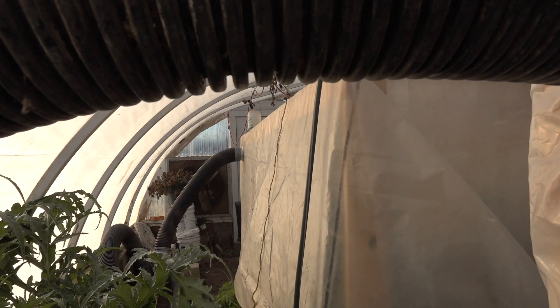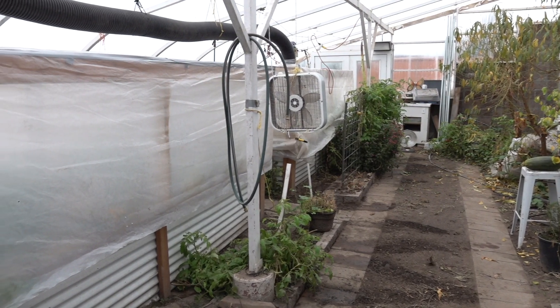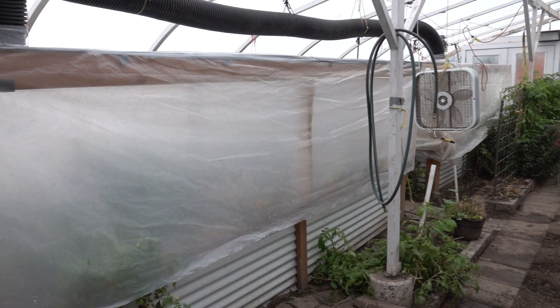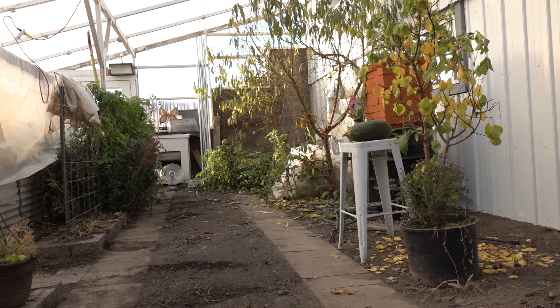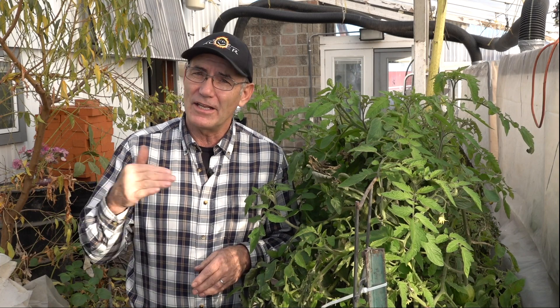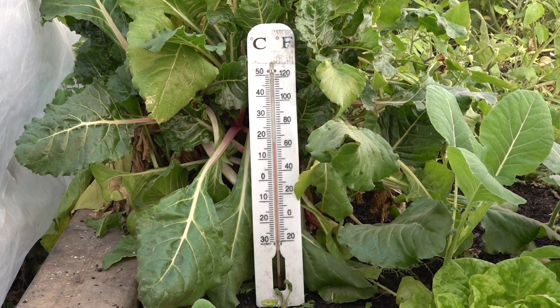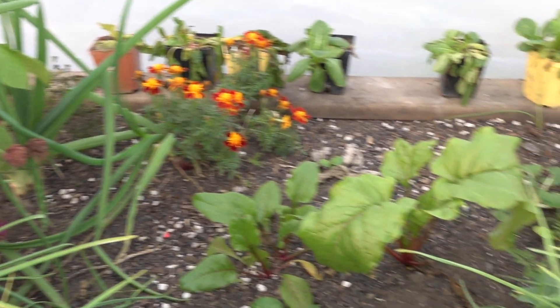To recap: having more zones in here has kept the temperature from freezing. Separating the climate battery zones into heated zones in the planter boxes and the shipping container has worked well. The fourth zone is still out here in the main room — we'll probably let that shut down after the tomatoes are done, which will be pretty soon, and allow the trees to winter and the ground to freeze. I think that's probably a healthy thing for it to do. But in the enclosed zones it should never drop below 63 degrees, and we can always put a small space heater in there if needed.